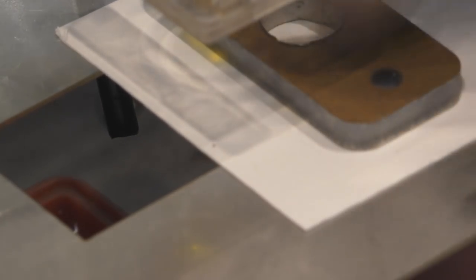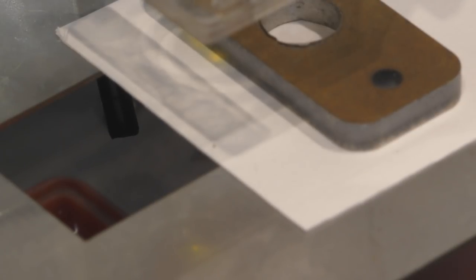To make sure everything stays flat I'm putting a small weight on the paper so heat doesn't cause it to buckle. Here's a quick pulse — look at that lovely small hole, exactly what you'd expect from a 38.1 millimeter lens. Now I'll start holding the pulse on a little longer, as if doing a cut. I'm gradually increasing the power so I don't catch fire — I just want the little speckles around the outside.